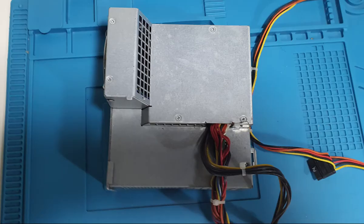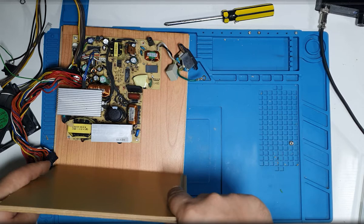This is our computer power supply. You can take it from a desktop computer or buy it online. It typically has outputs of 12V, -12V, 3V, and 5V, which we use for our power supply. When opening the power supply to access the circuit board, be very careful — these are high-voltage devices connected to 220V mains, which can be very dangerous. You need to be qualified in electronics, have PPE (protective equipment), or ensure the main power is turned off.